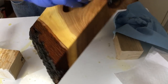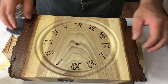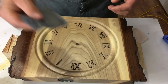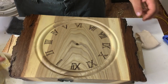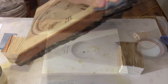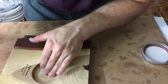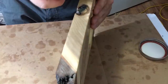After a few coats, I've got three coats of that water-based poly on and it's now sealed up the wood really well — it's just starting to build up on the surface. Next I'm going to scuff the surface down with some 4-aught steel wool, and then buff on some beeswax thinned with mineral spirits. Please protect your eyes and lungs when working with steel wool. I rub a generous amount of wax over the entire surface, let it sit for a minute, then buff it vigorously to create some heat which drives out the mineral spirits, leaving a nice matte sheen.